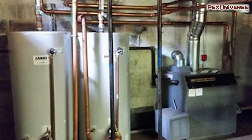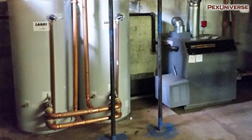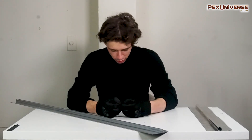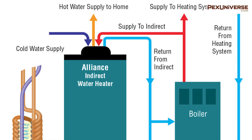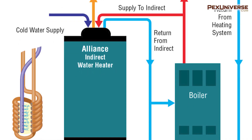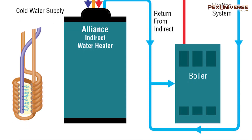If you are installing underfloor PEX heating, you should have a separate and dedicated hot water heater. This is because underfloor heating operates at a much lower temperature range — roughly around 95 to 114 degrees Fahrenheit — which is different from traditional hydronic heating systems. The heat source is usually a condensing boiler or a heat pump, both of which are well matched to these lower operating temperatures to maximize boiler heating efficiency.